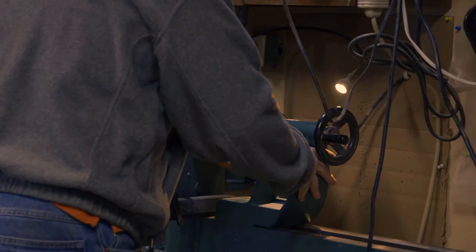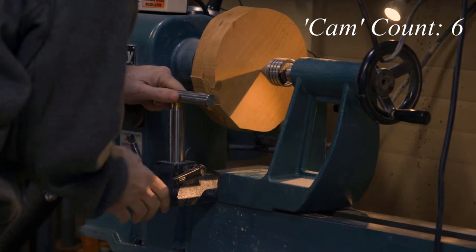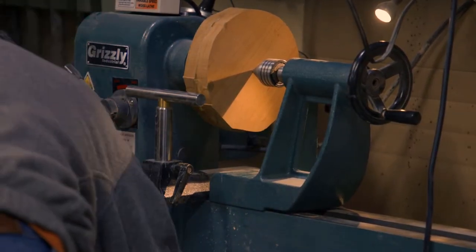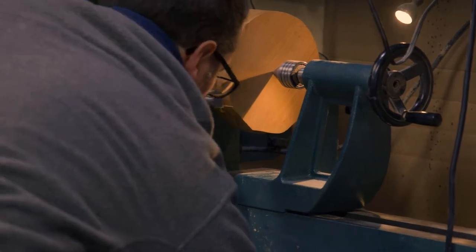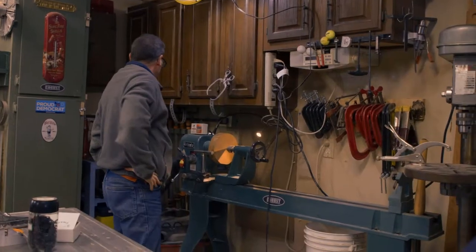Slide it down, get it in. Okay. Now it's not hitting the center. That's fine, it's good. You can't tighten it first otherwise you just push it back. Push the lever down - it's a cam. Okay, you've got a problem. Stop. Get it loose. Reach underneath the lathe - way underneath it. There's a nut, a big nut. Give it a little turn. Tighten it? Yeah, it loosens it. Now use the cam. There you go. Now it should tighten.